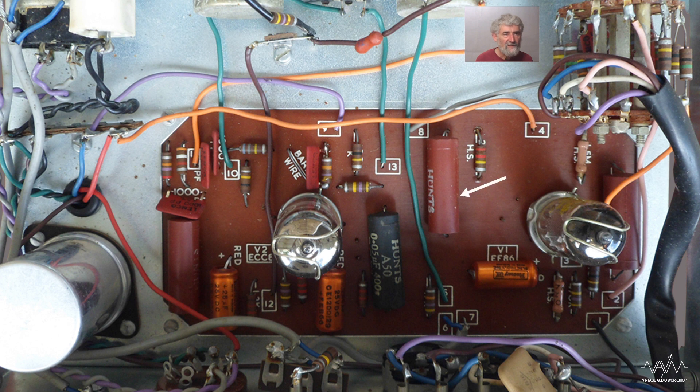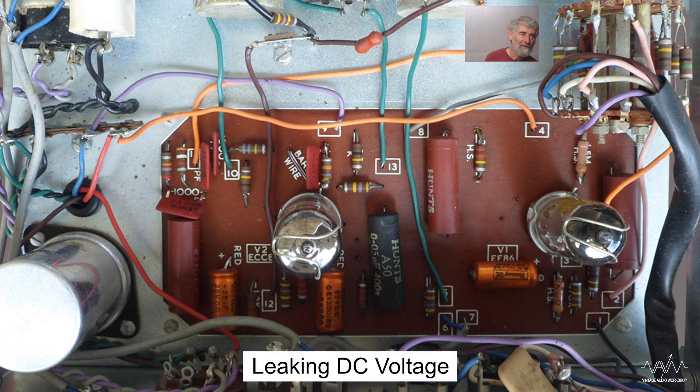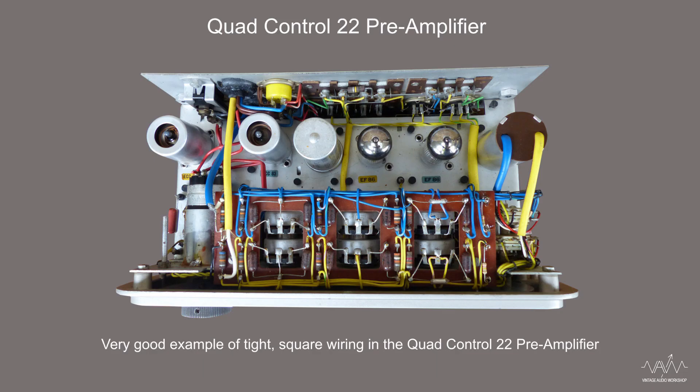If you bought one of these, those components look like they're going to need to be replaced - they're almost certainly leaky. These look very much like wax paper capacitors and at this age they're almost certainly leaky. This unit has been nicely built and the wiring is neat, not perhaps up to factory standards - for instance, this mauve wire goes over there and gently bends. If factory made it would be sharply right-angled and down. But if I had built this I'd have been quite happy with my standard of work.